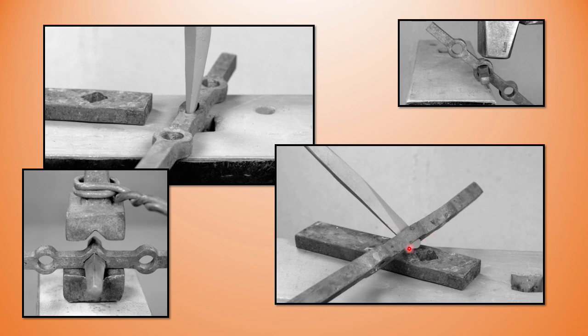You can clean up this hole on the edge of the anvil; if you've just got one or two to make that's an excellent way to do it. If you have a lot of these to make, then we're going to make top and bottom V-swages — another level two project. I've taken my bottom tool, folded it in the corners, put a piece of quarter-inch round around it so it's handled, and that's something I can hold with my tong hand as I go to work.